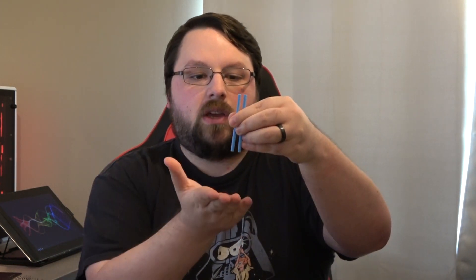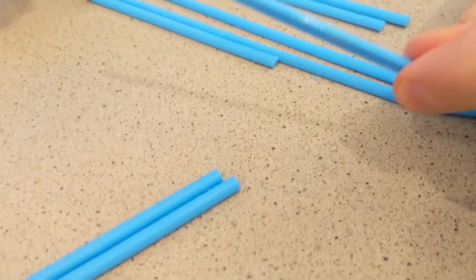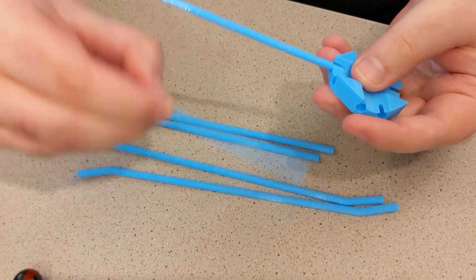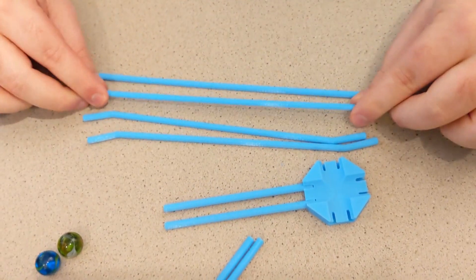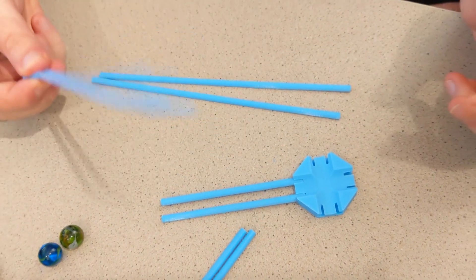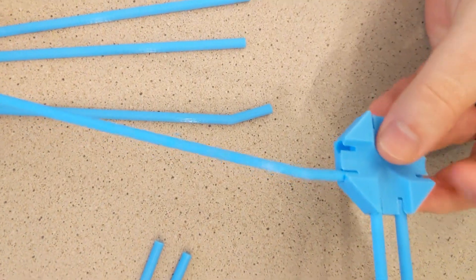The problem was these poles are very tiny and very hard to print. The first attempt had them printing upright on the bed, and anybody who's used a printer knows that's not a good situation — very easy to pop off, and heat differences along the way can cause inconsistency. So I tried laying the poles down and cutting into them a little bit so they'd be mostly cylindrical with a flat edge, making sure the flat edge wasn't where the marble sits. They worked a little bit and were easier to print, but ultimately there was a lot more maintenance involved — making sure you have all the right pieces and that they sit in the holes as well as I'd want. So I decided to go with a second idea.